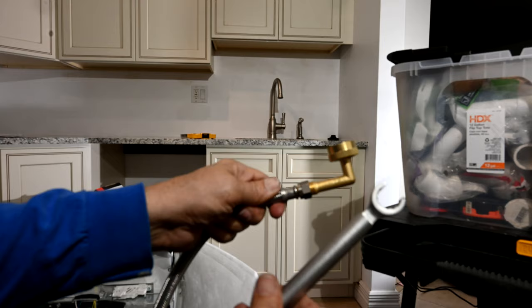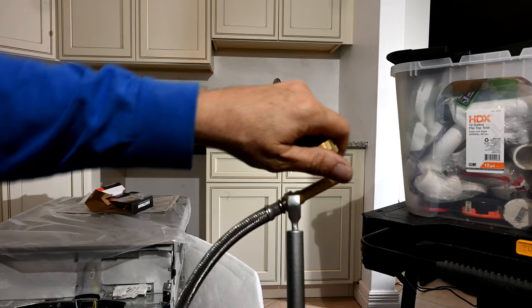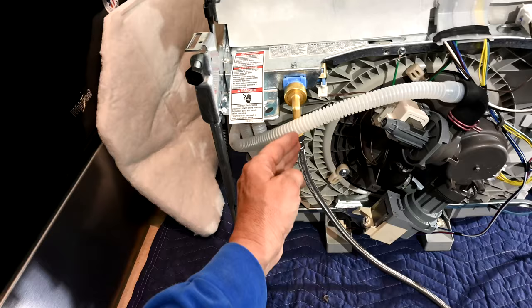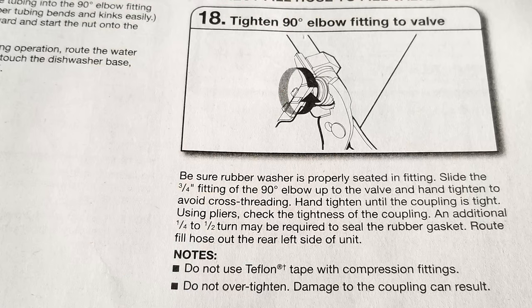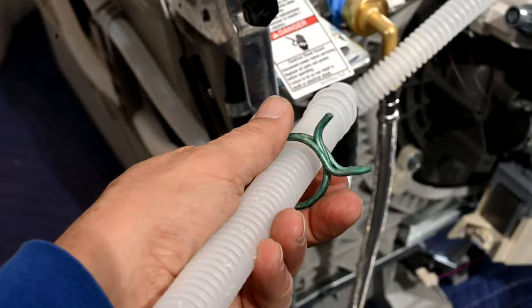Take the Ridgid one-stop wrench — the 3/8-inch side of this little wrench will tighten the 3/8-inch side just a half turn past hand tight. Now attach the 90-degree piece right onto the inlet. As you hand tighten it, you can see the orientation — it has to go straight out towards the back of the dishwasher. Once hand tightened and you're sure nothing's stripped, take a pair of channel-locks and tighten a half a turn. Remember, no Teflon tape unless your manufacturer specifically states to add it.